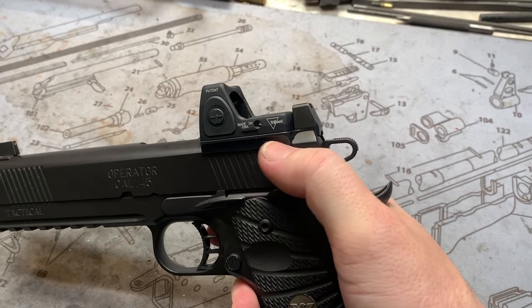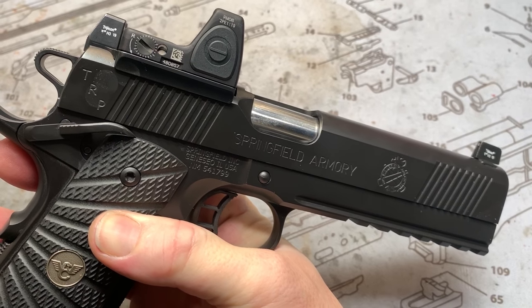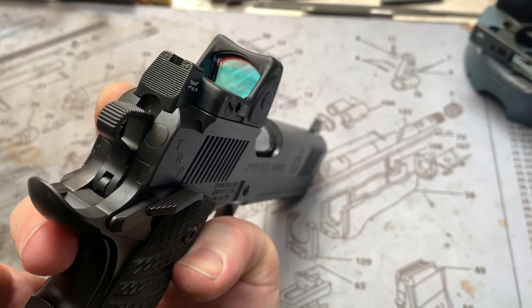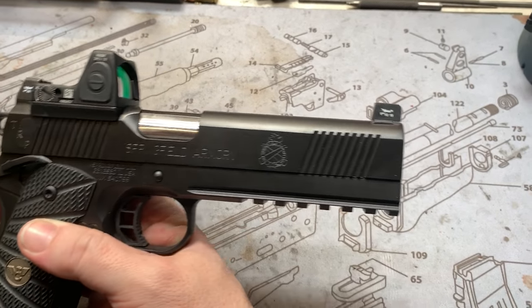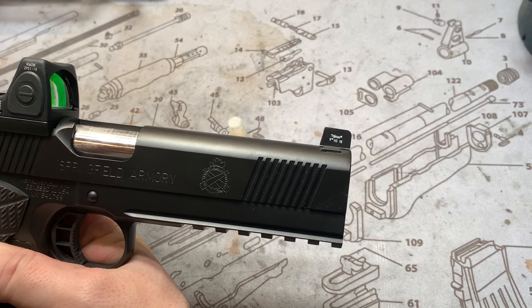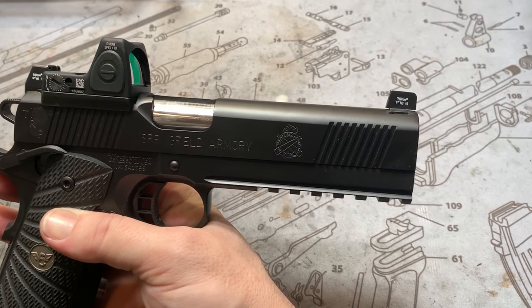It's a little bit challenging because the sight cut for the original Bomar sight is a little bit too big, so we actually had to weld up the rear of the slide to get that sight to look really nice in there. We basically fit the Trijicon RMR mount and redid the front sight. These are already cut from the factory, so we welded it up so there'd be no air on the sight because it was a little bit ill-fitting. You can still see a little air underneath of it, but that's pretty much what that is with that cut, unless you weld up the whole slide.